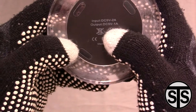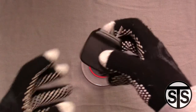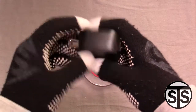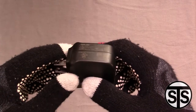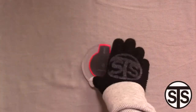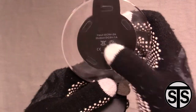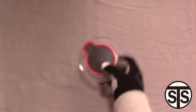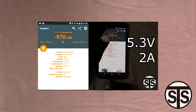The output is 5 volts, 1 amp. Let's try it out and see how good this thing actually is. They don't give you a power supply, so I'm going to use this ASUS power supply rated at 5 volts, 2 amps — that should be plenty to power this, which is what it requires: input 5 volts, 2 amps to get that output of 5 volts, 1 amp. By the way, you can click here to view a video I made about charger ratings for more information.